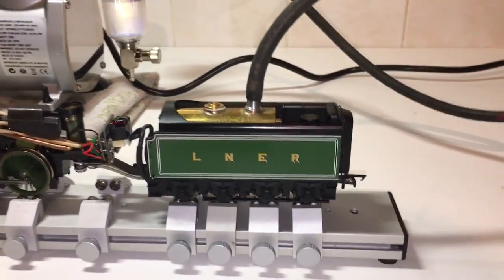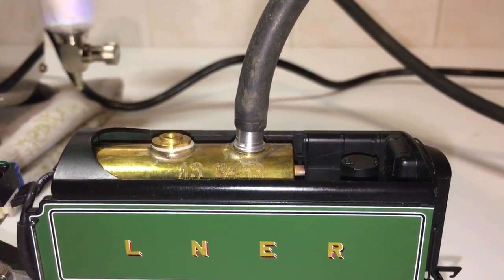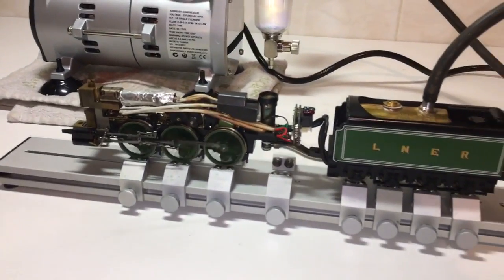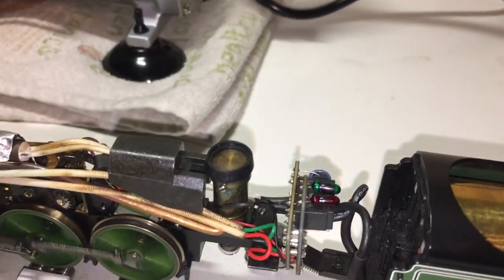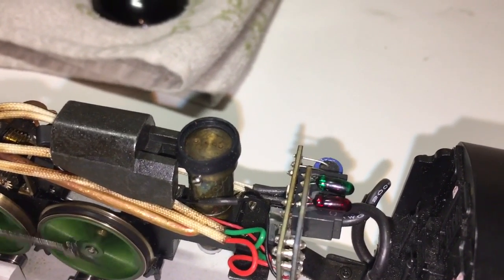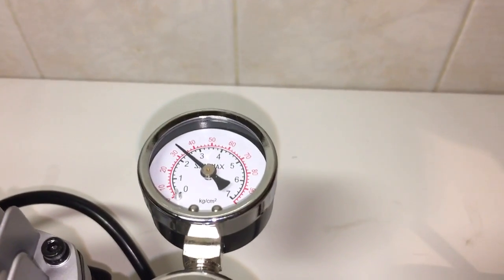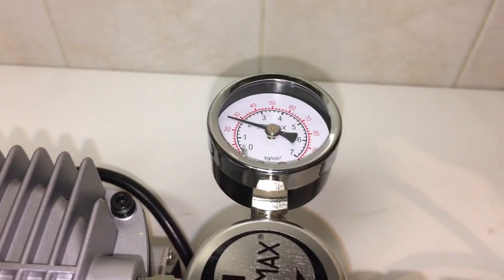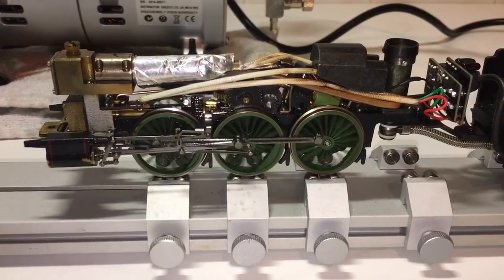So if you're interested in trying this out, you will need an adapter - we supply these at the IO-LIFE STEAM Club shop - and you'll need to buy yourself a compressor and a bit of hose. Apart from setting the timing, you can adjust the pressure by removing the cap from the pressure valve and adjust it almost continuously while it's running to get the pressure you desire, which will be shown on the gauge. I'll now turn the unit off and the pressure will start to drop. The loco continues to operate on the residual pressure very smoothly.